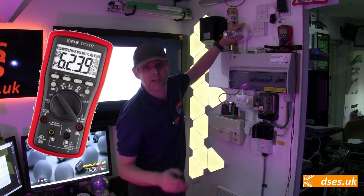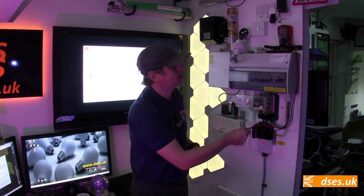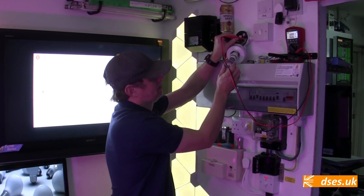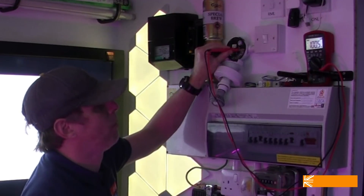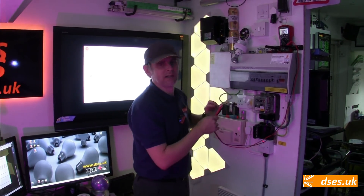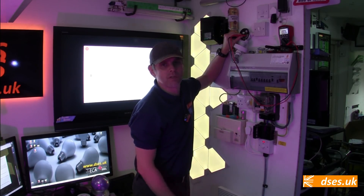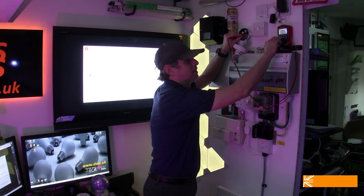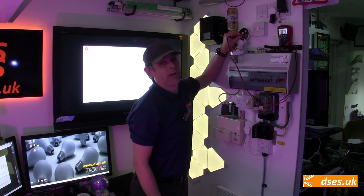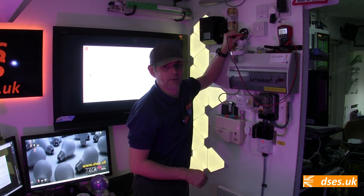This is a new instrument to me and I've got no manual for it. We can see our light's glowing. Let's switch that back to volts and turn on the rather nice backlit display. If I put it across line and neutral, the light is shorted out — it doesn't illuminate anymore — and we're reading 100 volts, about the same as before. However, if I switch it to the low impedance input, which I hadn't even spotted was there, it now only reads 7.9 volts. Being able to switch between the two is a rather handy feature, depending on whether you want to measure these stray voltages or discount them.